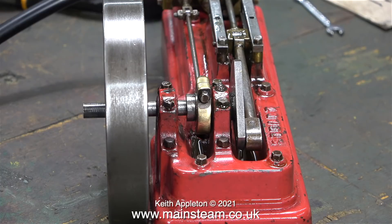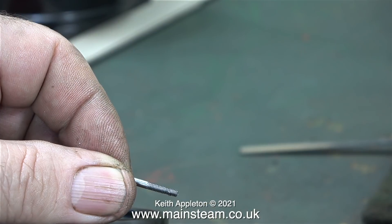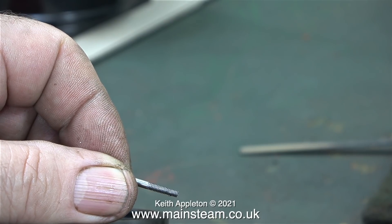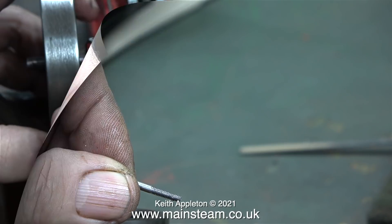This setting is quite close, but there's something I need to do first that I forgot — there are only two bolts holding the cylinder in place and there are supposed to be three. I looked in my box of 7BA bolts but I didn't have any that were the right length, so I modified a Stuart Models stud by threading it a bit longer. Once I fitted this stud in place, the cylinder was held very firmly.